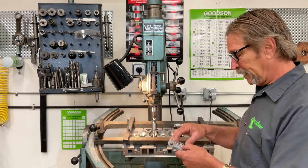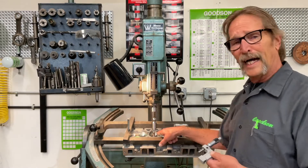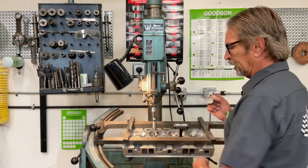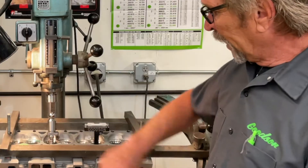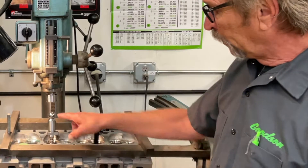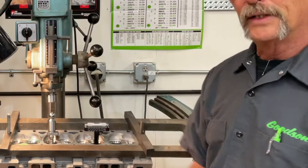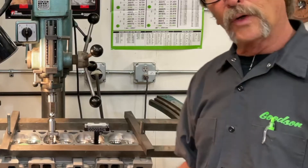I've got my unit level and I've already used my MGA Mic micrometer to set the diameter on this cutter. It's a great tool — you can eyeball it as well, and I know a lot of you do — but the MGA Mic is a precision micrometer that goes from just under an inch to right at three inches. It sets all your different diameters for seat cutting or counterbore cutting. I've got my ball head here — this is a number three Morse taper drive — to engage the one-inch perfect sphere on top of our ball head. I've got my pilot installed, I'm a bounce spring guy, and I've got this on number two speed, running at about 115 RPMs.